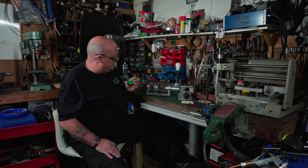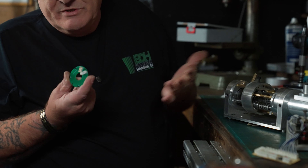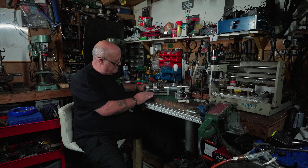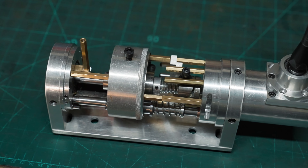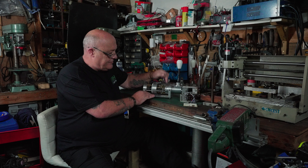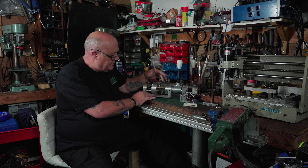This was a prototype for the H1 Bazooka, but the boards that go in here are pretty much the same — little non-contact magnetic sensors. From a user point of view, dual mode shifters cause a problem: your third and fourth gear become your up and down in sequential. So in the software we've added a ninth sensor — these are eight gears — so when you lock over to sequential mode, that sensor tells the software to negate all the H gears and turns third and fourth into up and down, with no conflict in the software, game, or simulator.